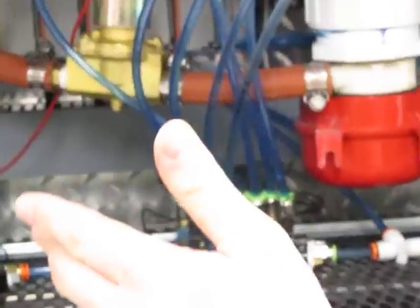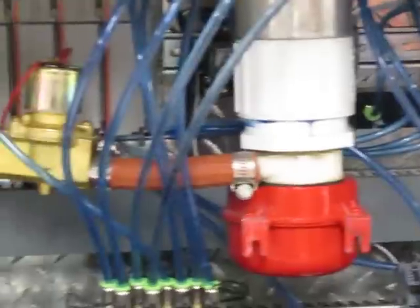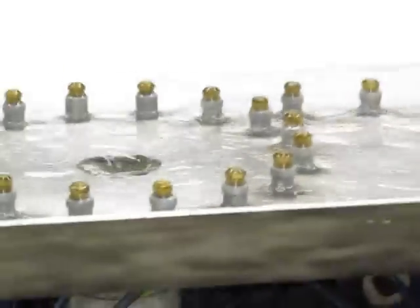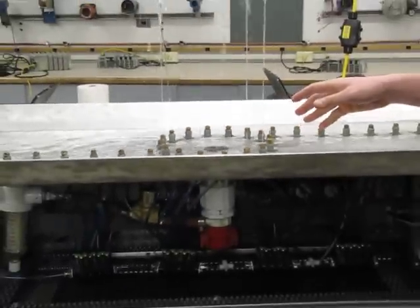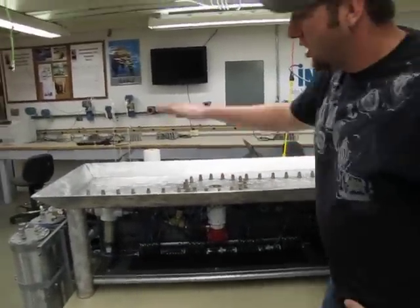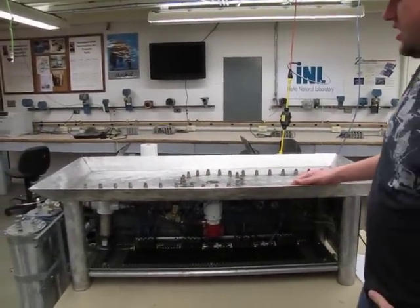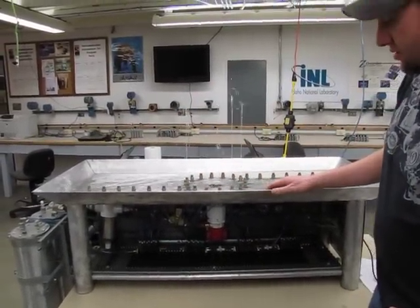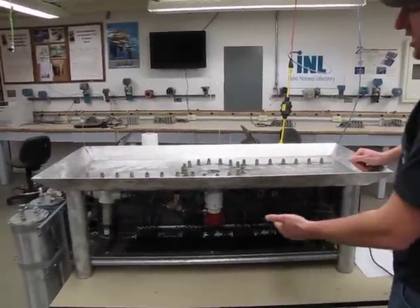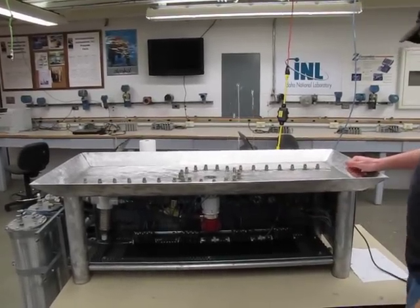You just have two level sensors in the one tank that input to the PLC. The biggest problem we have is that we can't turn on more than three solenoids at a time because it drops the pressure — if you turn them all on, they all start shooting really low. Another issue is you can't have them coming up very high because they start missing the table. About five PSI is all you need to run this thing at the career fair.